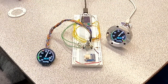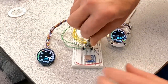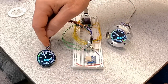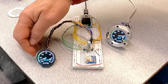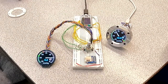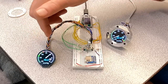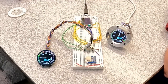Thanks a lot. So this is a little more close up, and you can see the gauge bugs that I programmed to move around the outside. Basically, when the vacuum gets above this one, it'll shut the vacuum off, and when the vacuum goes below the red one, the vacuum pump will turn back on. And then it's got a little blinking LED in there that shows you if it's below, into the red, it flashes red, and anytime it's green, then you're good to go.